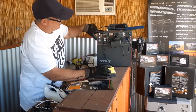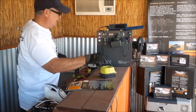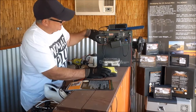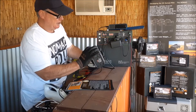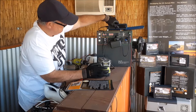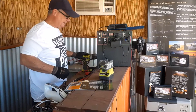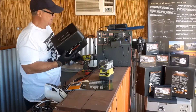When the drill battery is flat you'll see the current come out — first the inverter starts up, then the charge for the battery begins. Once it's charging, if the battery were empty it would pull around 6 amps. As you can see now it's showing 5.8 amps, but this battery was about three-quarters full, and that also includes the USB plugged in. The inverter itself pulls about 0.5 amps.